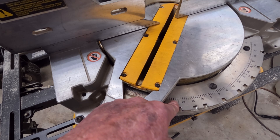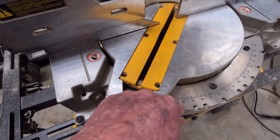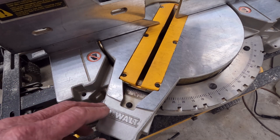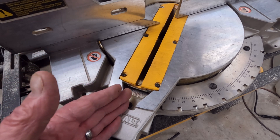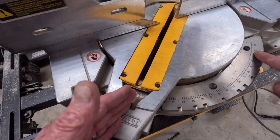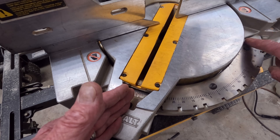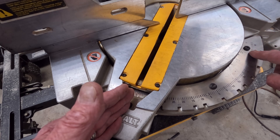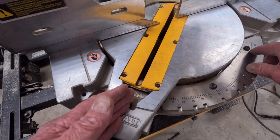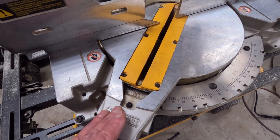As you can see, my miter saw goes 25, 24, 23, and then 22 and a half. But over here I've got it set at 44 and three-quarters — just a little bit to this side of the 45, and it would be the same thing on the other side, just a little bit to that side of the 45. So because the markings are on the Sawset that aren't on my saw, it's no big deal. Just fudge it over just a little bit off of that 45 and you'll get your 44 and three-quarters and have a nice tight fit.